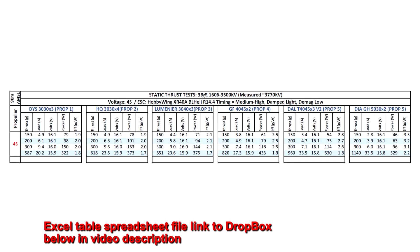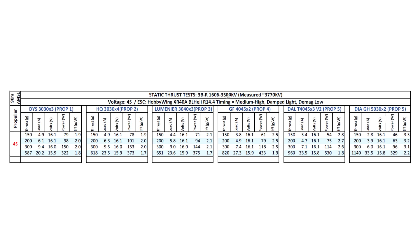Alright, let's look at the results for the thrust test on this motor — the 1606 3500KV. The motor actually measured quite higher at 3770KV, so it's about 270KV higher than rated, which is unexpected. I had pretty good expectations and the motor performed quite well as far as thrust is concerned. I only tested a few props because I knew about the overheating issue, just to do a couple of props and see how hot it would get. And yes, it definitely got hot.